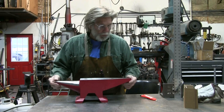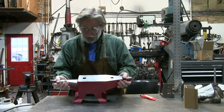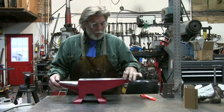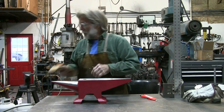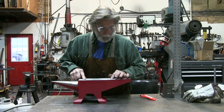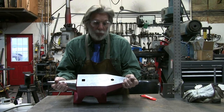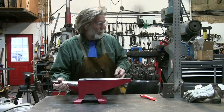The horn tapers up to a nice little point. It's a little rough on the back end — a couple of little nicks. There are three nicks in the face right out of the box. It's got quite sharp corners on the anvil face, which I'll radius some off so we don't gouge our metal when forging. It's got a square hardy hole — three-quarters of an inch — and a round pritchell hole. The pritchell hole is a little larger diameter than I'd prefer, and it's more oval-shaped from the casting, but that's okay.